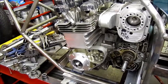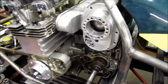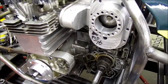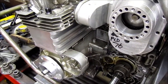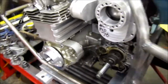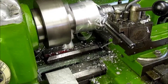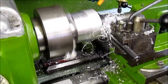Here's the spares bike again — it's noisy in the background because Jeff's got his lathe on. What's needed today is a snout to bolt on which will carry the drive from the crank up to drive the supercharger. The side plate has already been made. The noise in the background is Jeff machining that snout from 6082 alloy now that the materials have arrived from the supplier.